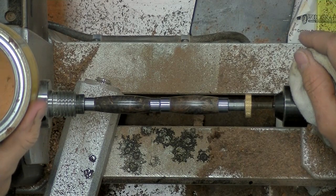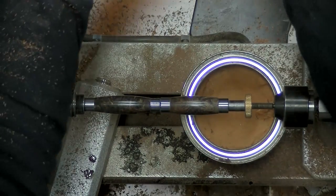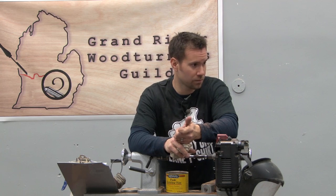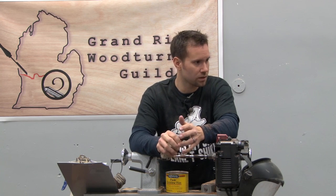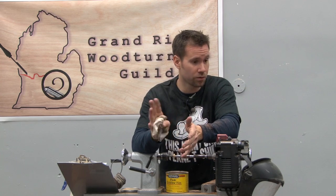Don't skip your grits. If you noticed, I went right from 80 to 120. Don't go to 220. You'll be there forever trying to sand out those rings. But as long as you don't skip your grits, you'll eliminate those rings as you go through your progression.